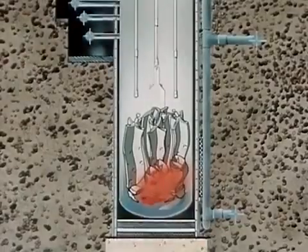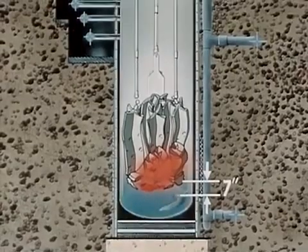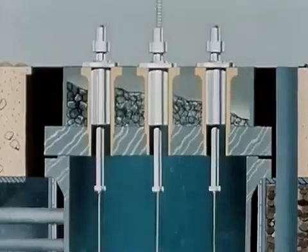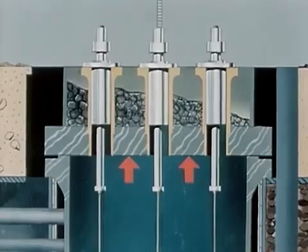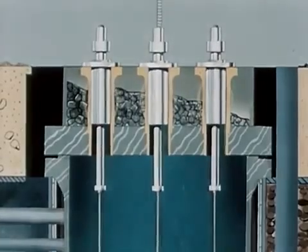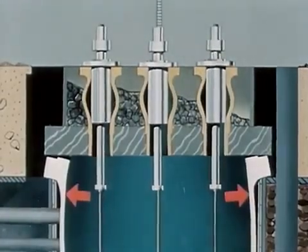While the water was moving upward, the core structure jumped, reaching a height of seven inches above its supports when the water hammer hit the head. As the water was decelerated upon striking the vessel head, the forces generated collapsed the shield plug guide tubes. It also deformed the vessel wall and the vessel head nozzles.